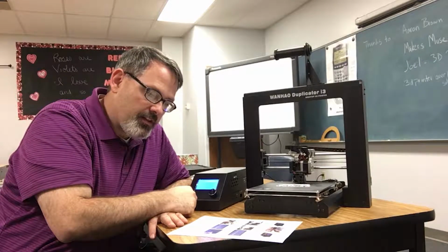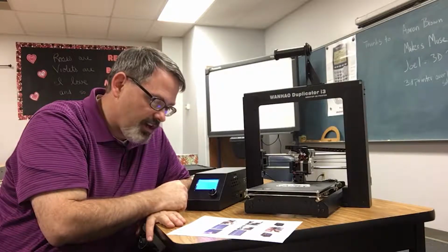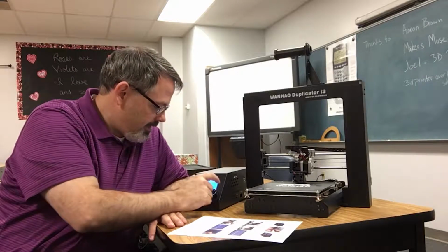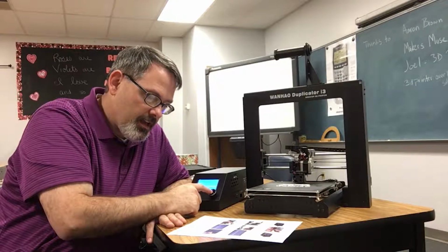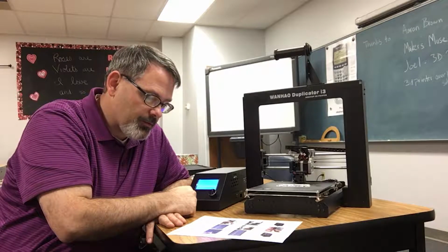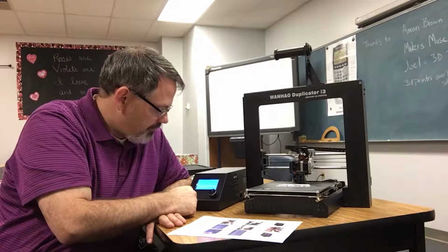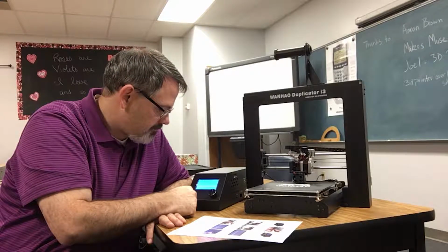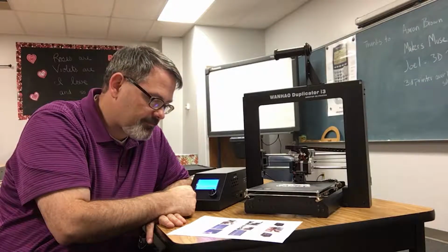So I pressed the knob to enter the menu system, and I'm turning to quick settings and pressing the knob again, and then the preheat PLA entry and select it. Note that the screen will not change immediately, but will return to the home screen and display preheat PLA at the bottom for about 15 to 30 seconds. It does that. It looks like I haven't selected it.